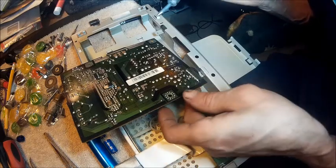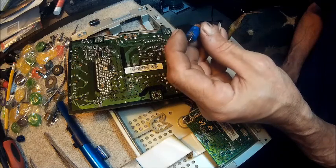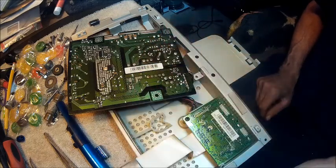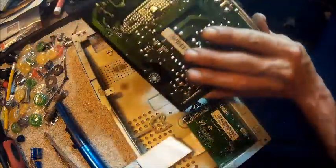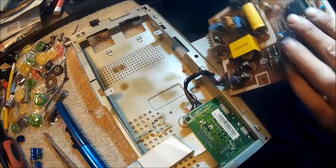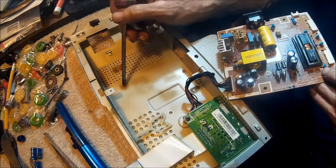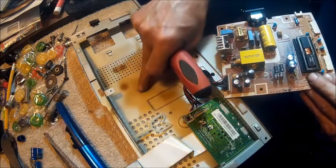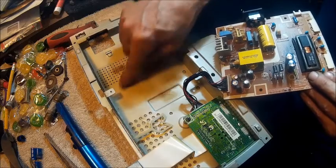Now I'm gonna re-solder this one here, melt it down a little bit. Now we've got a hotter iron. So now we have to wait to get the other parts. You can see that one got pretty hot. Let's just hope this works after we get all the bad capacitors done — that's all we can do. You can see where those two were, where they got hot right here. And you can see where all those capacitors got hot. The brown discoloration is where them capacitors got really hot.